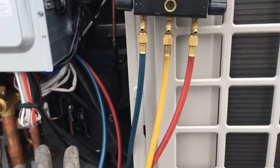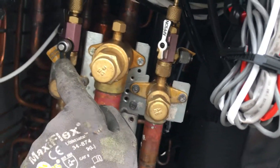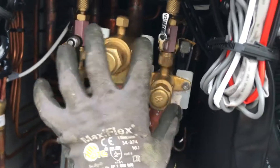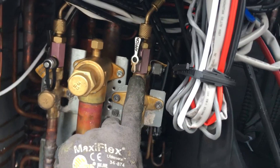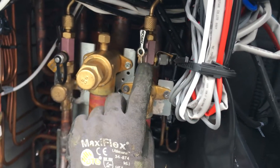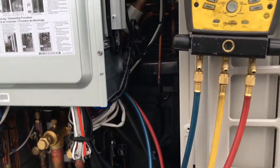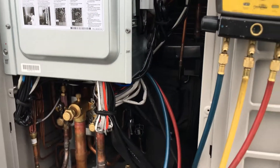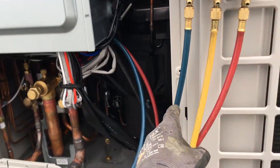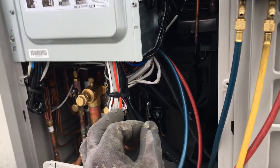This is not the setup I'm going to use for the full test. You definitely do not do your high-pressure test through a pair of adapter valves like these Appions or any other brand — that's another potential leak point. Don't trust these; I've had them leak before when you get up to 400 or 600 psi. Don't use these for high pressure, or you'll waste time looking for a leak that was just your valves. Those will be removed.